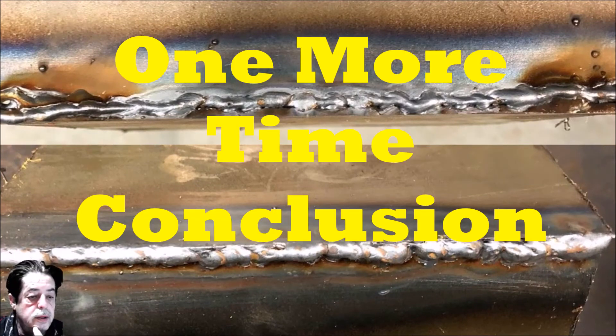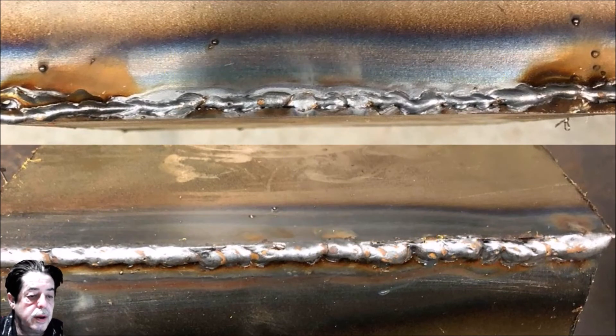Let's recap everything. Sometimes your metal has mill scale on it, or cosmoline — an oil byproduct they put on steel to protect it from rusting during shipment. I wipe down those areas or the whole thing with acetone to get it really clean, since I'm going to paint or finish it anyway. Then wherever those welds are going to be, I might use a flap disc or grinding wheel to clean it up and make it shiny — that's weld prepping.